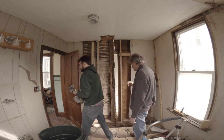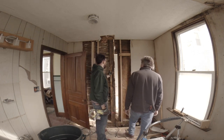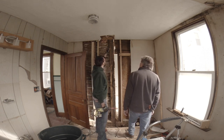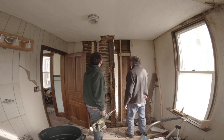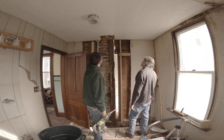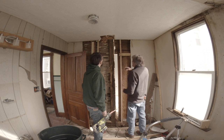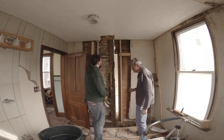Let me get a bigger blade. So here's my thing — if it does bind up here, if there is weight on it, it's more prone to collapse because it doesn't have a soft footing to rest back down on, versus if we were to cut it up here. That makes sense. So you were saying the first cut's usually the easiest to get straight? As long as there's good meat on both sides — if you're trying to cut a little bit off, it'll always want to wander into the easy part. So why don't we start at the top?